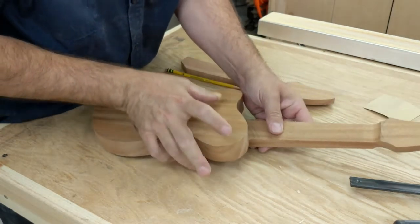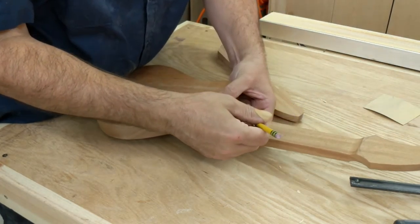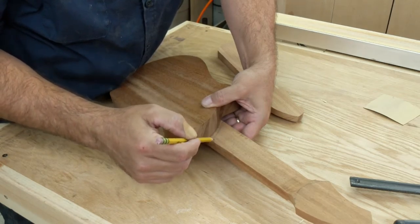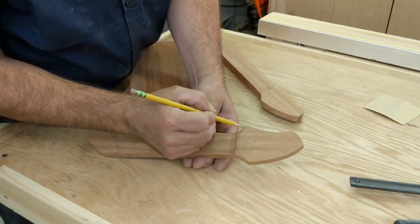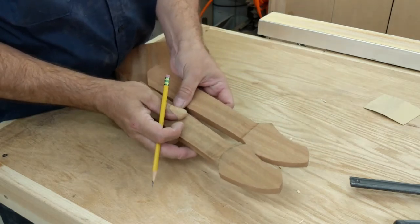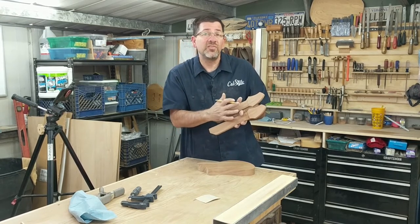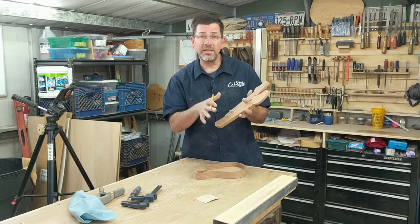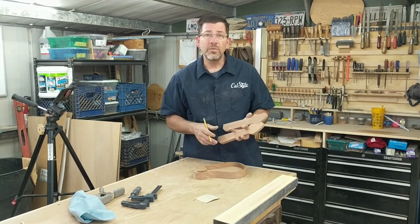And if you turn this over from the back side, essentially it looks about like this. And you can see I can mark where the neck hits the body right there. And then I give myself a little bit of leeway, so I'm gonna do my neck carve right down to about this line, about a quarter inch out. And then my blend up here at the headstock will follow this arc right here with the two headstock curves, and I'll blend that carve in with the headstock there. Now the nice thing is I can do that with both necks at the same time. I mean, not literally the same time, one after the other, but the necks will essentially be exactly the same, even though the nature of the two instruments is a little bit different, the body shapes are the same, and the connections from the neck to the body will be the same. So I can go ahead and work on both of those necks while the glue's drying on those other things. So we'll jump right into that.